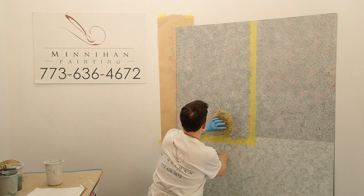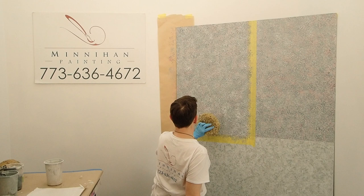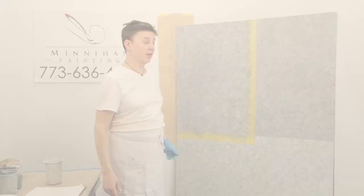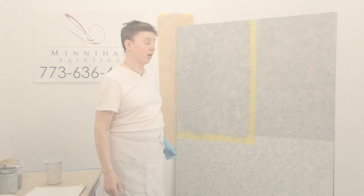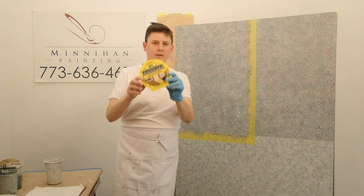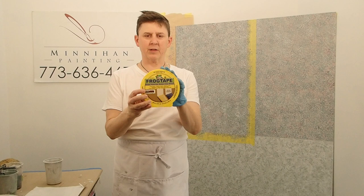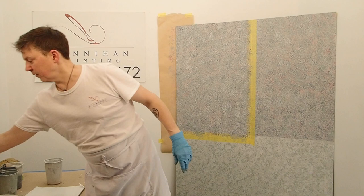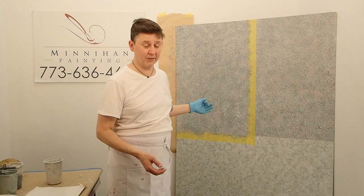If you need to get ahold of me, my number's up there. In addition to all this decorative painting, murals, and everything we do, I have a crew of five painters and we do regular interior and exterior painting — that's really the meat and potatoes of our business; this is more the gravy. The tape I prefer is Frog Tape. You pay a little more, but it's worth it. It's great for doing lines, it really blocks any bleeding, and it's pretty much safe on your surfaces — unless your surface wasn't painted correctly the first time and it pulls paint off, which means someone didn't do their priming and prep.